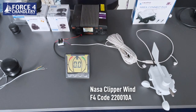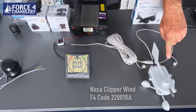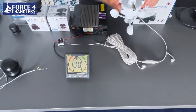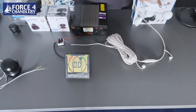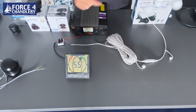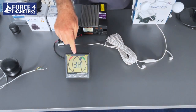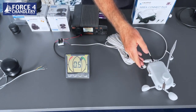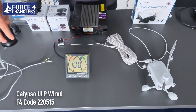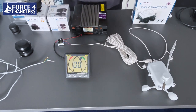This is a NASA Clipper wired wind setup with the instrument, the junction box, the mast cable and the masthead unit. It's a traditional vane and cups masthead unit — when you move the vane you'll see the indicator showing the direction of the wind, and when you spin the cups you'll see the velocity of the wind in the centre of the screen. I'm going to show you how to wire an ultrasonic wind sensor directly to this junction box in place of the NASA masthead unit.